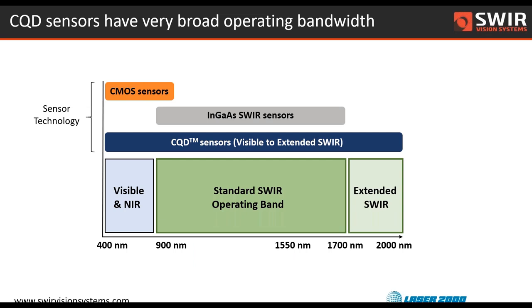I had mentioned the wavelength bands, and this is a nice chart to show how the spectral sensitivity of our cameras compares to more traditional sensing material systems. CMOS, on the blue end of the spectrum, does a great job in the visible region and can reach out to about 1,000 nanometers where the silicon band gap edge sits. But the sensitivity in the near-infrared around the 900 nm region for CMOS is dropping pretty fast.